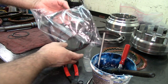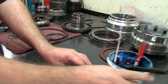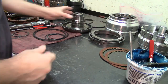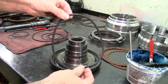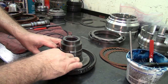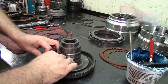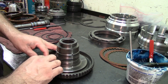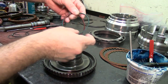It's hot weather so I use green assembly lube to hold my parts in place, and I use blue assembly lube to lubricate o-rings, lip seals, and all that stuff. Make sure it's molded. Now we put our input shaft aside and go ahead and get our o-rings out of the bag. Get the old o-ring out of the way. Lip seal - the lip goes down. Get it in the groove.